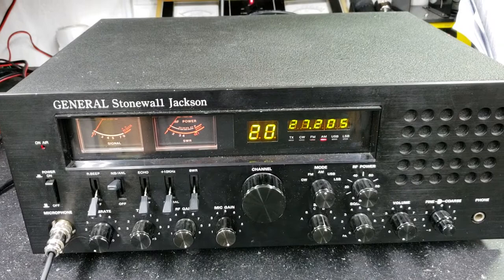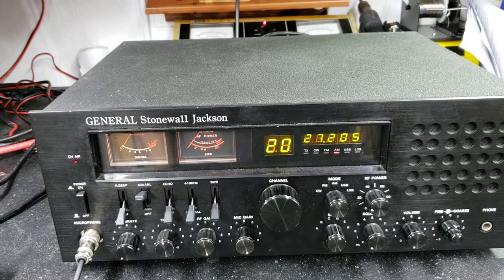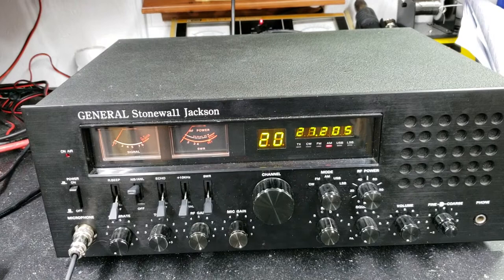After that we did a tune and alignment. We found the power supply to be subpar — it had about 100 watts of output, so we replaced the power supply and did an upgrade on it. We also found that one of the two transistors in the amplifier section was defective due to heat. The transistors were replaced; they now have two brand new HG2290 transistors. And of course we had to retune the amplifier section as well.